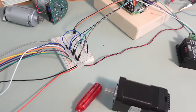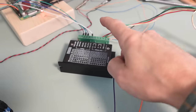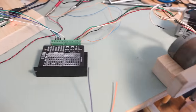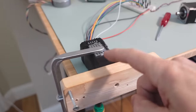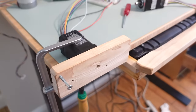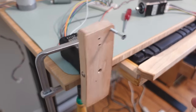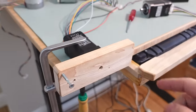This is just some jumpers because I was playing around with the wiring. Whereas with a stepper motor I need a stepper motor driver in between to give the current it needs. Now doing that same motion with this closed loop stepper motor — if I stop it from turning, it'll just catch up. I can even disturb it while it's stopped and it just goes back to where it's supposed to go.